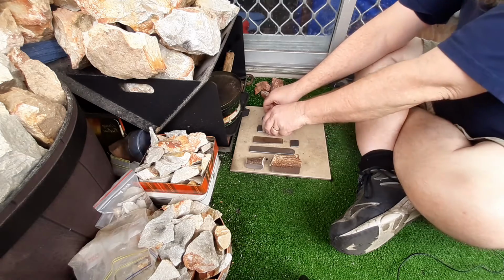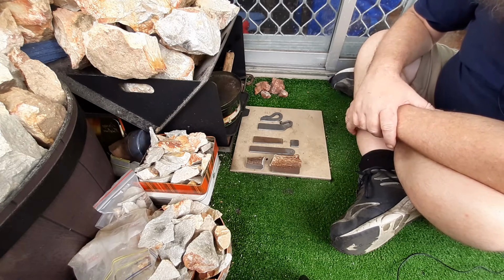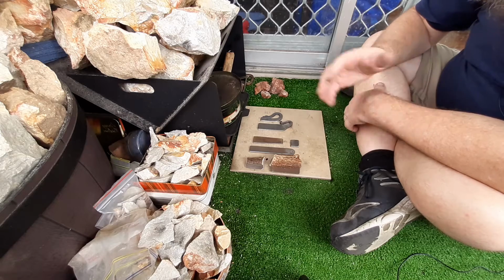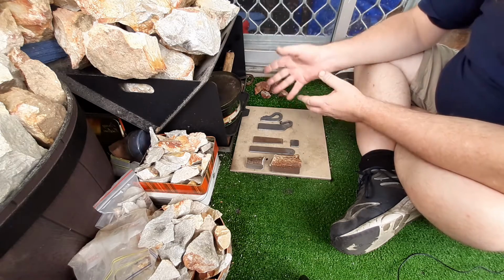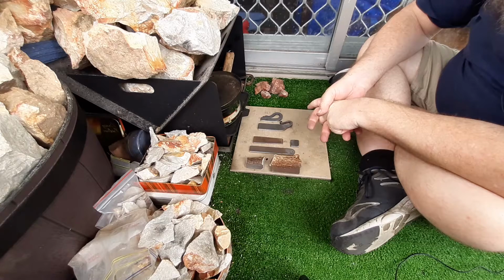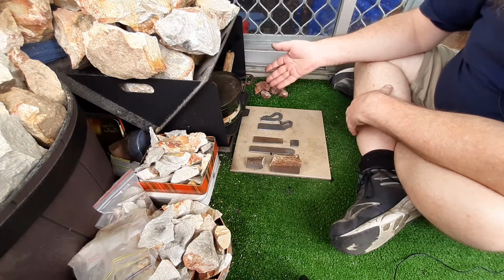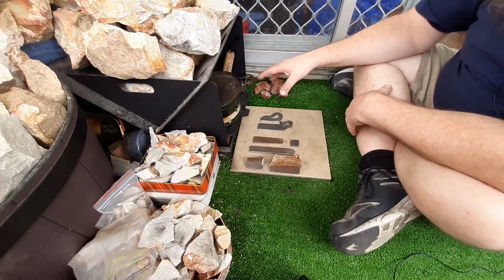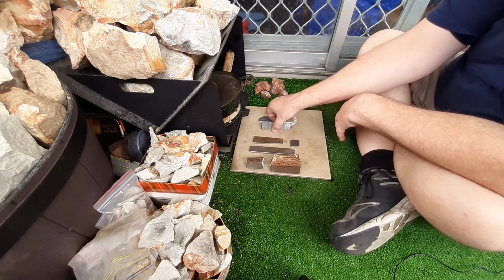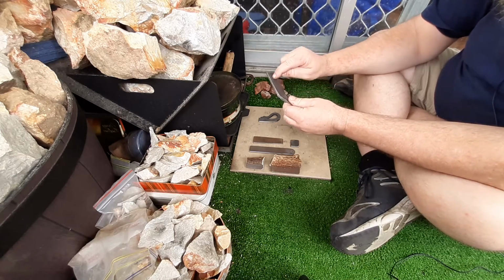And then onto the forging. If you've got access to a forge, and you can just do it with a gas axe, honestly. You get an acetylene torch, you can get them up to temperature, and you just need a magnet so you can go past critical temperature. Get them past critical temperature, normalise them once or twice. So forge them up, get them into shape, then let them normalise: get them up to critical temperature, set them aside, let them cool down naturally, then get them up past critical temperature so that they are non-magnetic, and then quench them in water. Just quench the strike face.